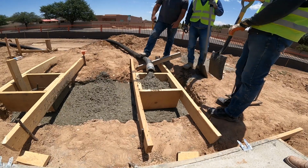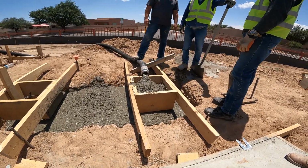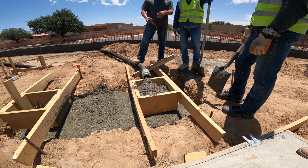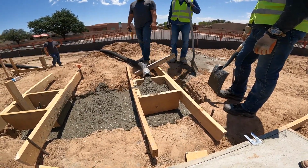So I stopped it. Like our guys would go through and start adding dirt around it so it doesn't slough out. Or they'd save some in a wheelbarrow. Go to that one, start filling, otherwise it's just gonna slough out and you're gonna end up shoveling after. So right, when it's too loose, right.